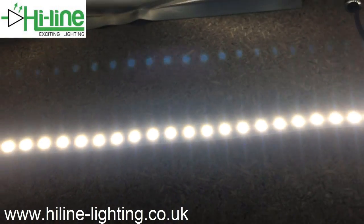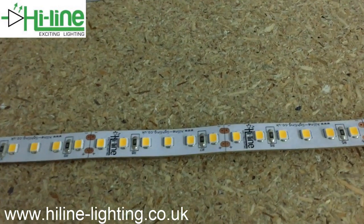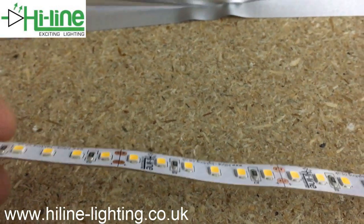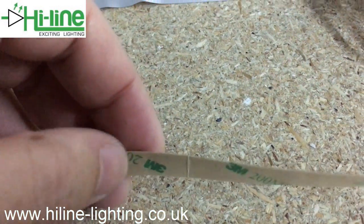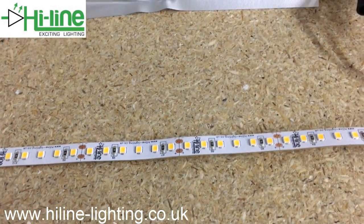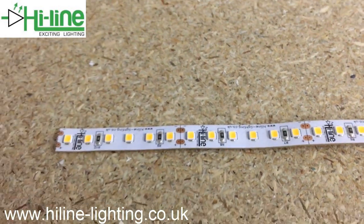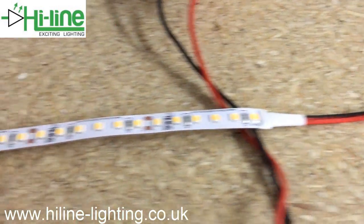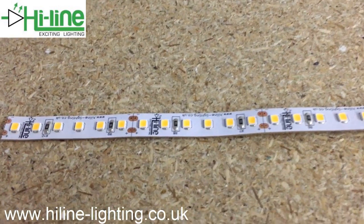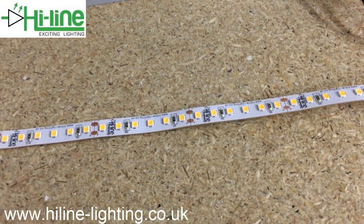Cool white has the highest lumen output. This LED strip is suggested to be installed on aluminum cooling — it gets a bit warm on the rear side, so it's better to install it on an aluminum profile or aluminum bar to ensure sufficient cooling. Every five-meter run can be powered from one end only, but due to the high power consumption, it is definitely suggested to terminate a five-meter run from both sides in a ring circuit.